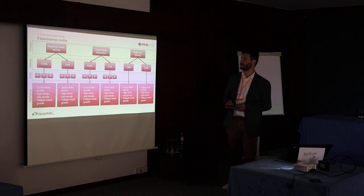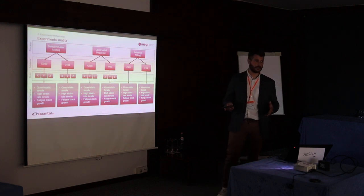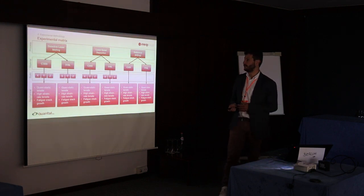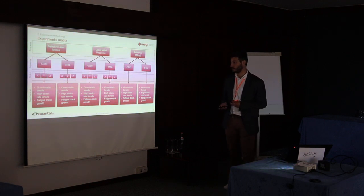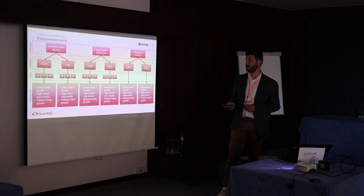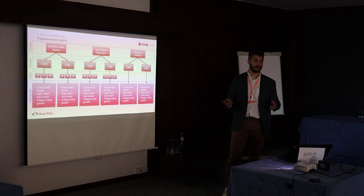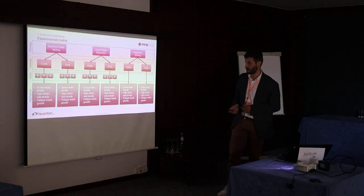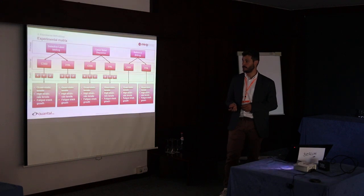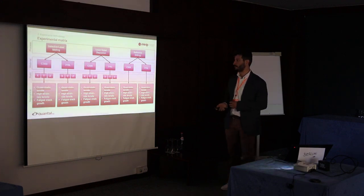In this way, we were employed to basically do a test and check how these processes affect their mechanical properties — in this case on two different materials: one was stainless steel and the other was a maraging high-strength steel — and to look at the difference in manufacturing direction. For reference, we also used some conventional manufacturing materials of the same kind as a benchmark. In this presentation, we will be looking at the quasi-static results, although other testing is either done or ongoing.